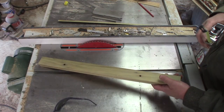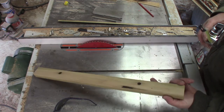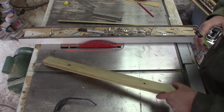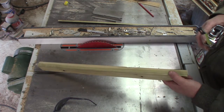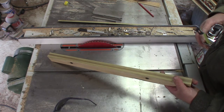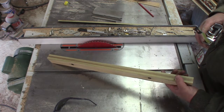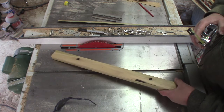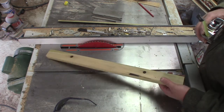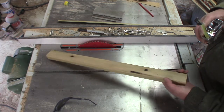The stock I've chosen for this project is a chunk of lumber salvaged from some old furniture. This happens to be poplar — it's probably 70-80 years since it was cut, so I know that it's very dimensionally stable. If you're going to build this same sort of project you can most likely use any wood, but if you can find some older wood that's done moving it'll just make the whole process easier. Poplar is not the hardest wood and it's probably not the ideal choice, but it machines very well and this particular piece is very dimensionally stable.